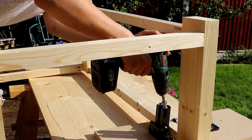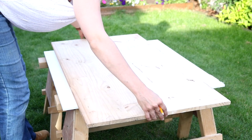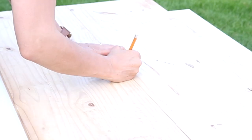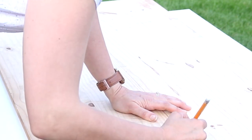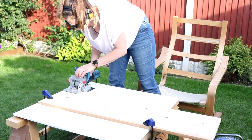For the pine top I'm using the last of some very old pine shelves we bought for our very first kitchen in this house. They were very grotty with food stains and all sorts, but I thought I may as well cut them down to size, join them together and bring them back to life. After cutting with my circular saw, I lined the two strips up together and made a few pencil marks for biscuit joins. I love my biscuit jointer — I was cutting size 20 slots for size 20 biscuits.